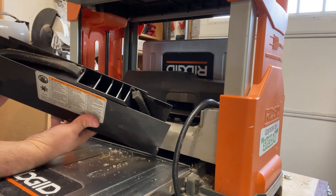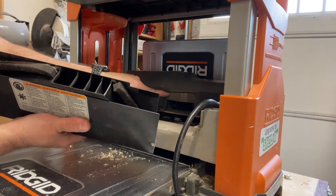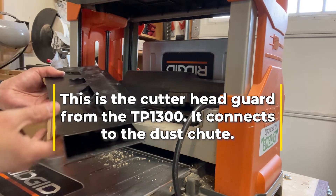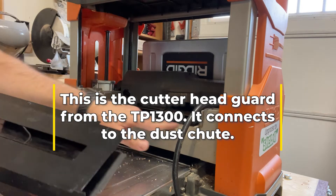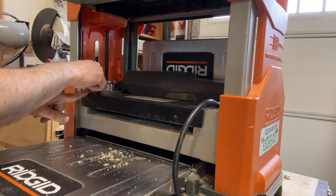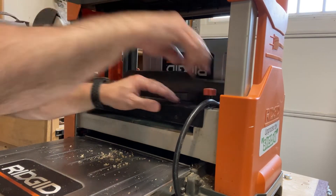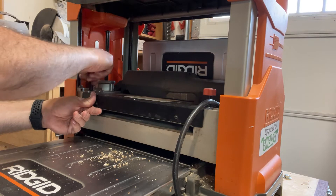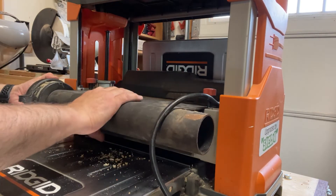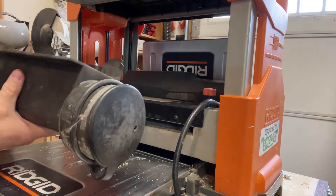The way it works on this one is a different dust collection mechanism, but the ports still line up the same. The dust comes out of the back of the motor into the cutter head area, then flows down into this open area at the bottom — and it'll still hold your cutter headlock down. The same two screws go in, then there's a big plastic chunk that goes under those screws, and the dust comes out from this area and collects through the dust shroud.